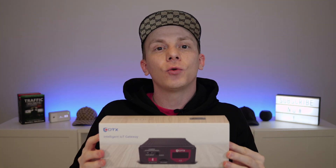Before we get started and look at what you get when you order your own Cortex X3 Helium Network Hotspot, let's take a look at some of the specs of the device itself. Just like most other Helium Network Hotspots, the Cortex X3 uses a Raspberry Pi mainboard and offers a gigabit Ethernet connection, Wi-Fi and Bluetooth to easily connect and onboard the Hotspot on Helium Network. The Cortex X3 is an indoor Hotspot, but you also have the option to either get a suitable outdoor enclosure or to place the Hotspot indoors and use an extension wire to install only the antenna outdoors. The stock LoRaWAN antenna shipped with the Hotspot offers a 3.5 dBi gain and should therefore be more than sufficient, especially for urban locations.